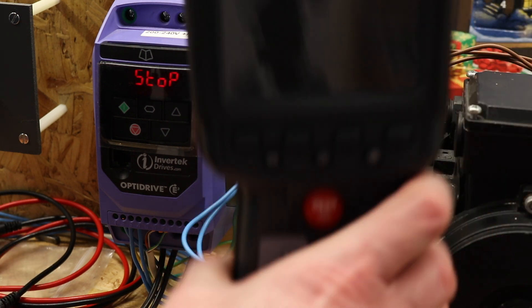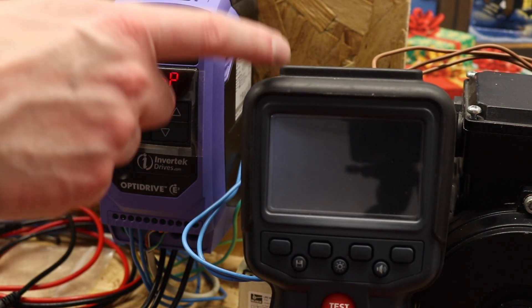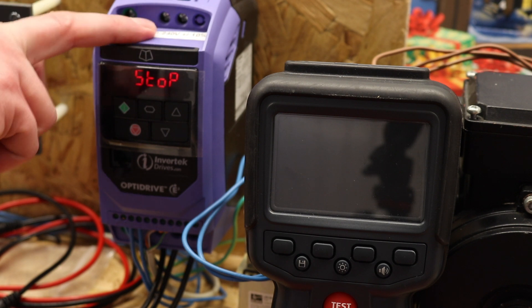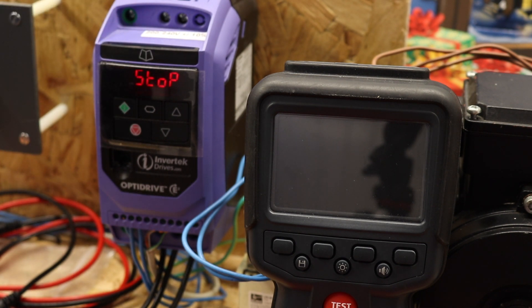The MTR-105 is a horrific price and is specifically touted as a specialist rotating machine tester with a three-phase mode built in. Given that a lot of motors are inverter-fed these days, I just don't understand it. I know that with filtration it does work — I've built a filter and have one that goes in the top of this unit. But in industry, you don't usually have inverters with a filter on the output. There are filters offered for drives but very rarely taken up, as there's no real standard for it — only if an electrical engineer is pursuing motor efficiency.